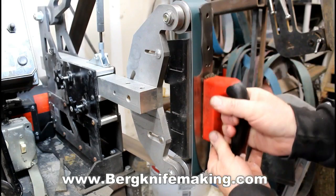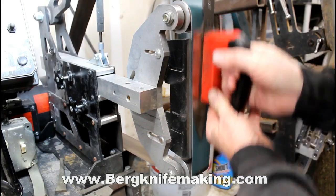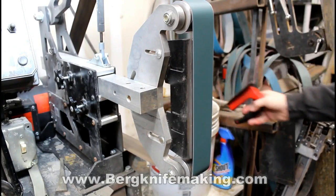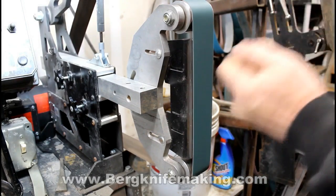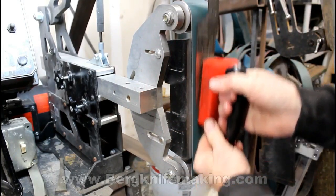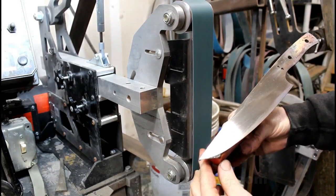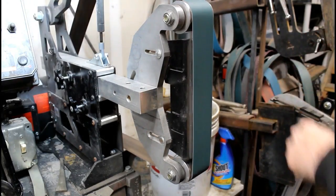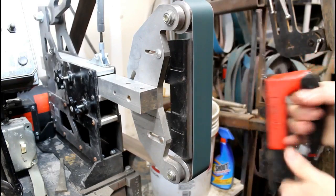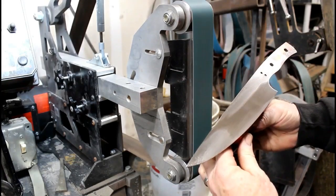We're going to do the post-heat-treating cleanup. I went back to the 2x72, using a handled magnet, vertical, and I'm going to grind with an 80 grit just to clean up the blade. You want to smooth everything out, get rid of any slag on the blade, and get rid of all that remaining color from the tempering. This process does not usually take all that long, but you do have to keep a good eye on the blade — you really don't want any of the deeper grind lines from the 60 grit used prior to heat treating.